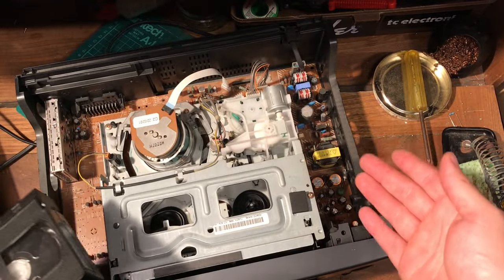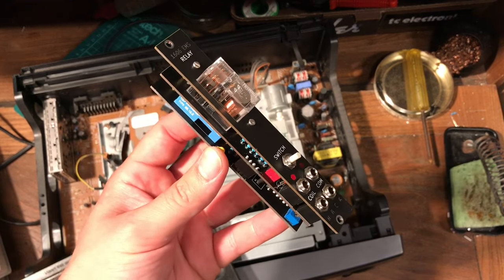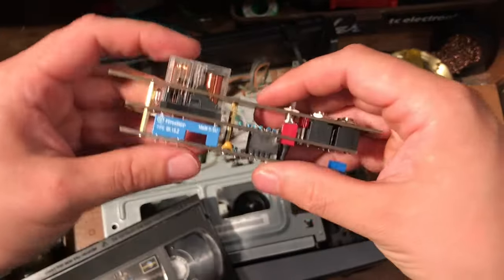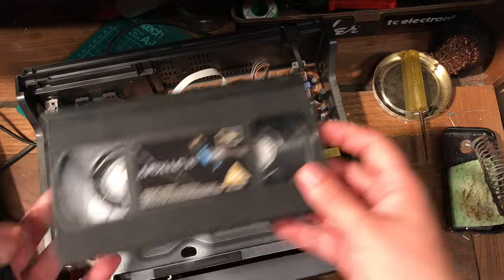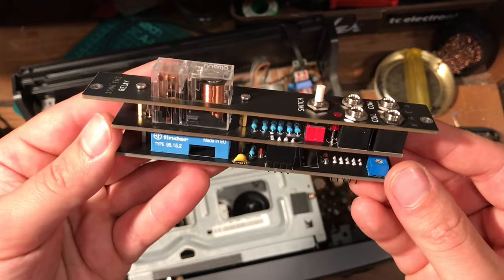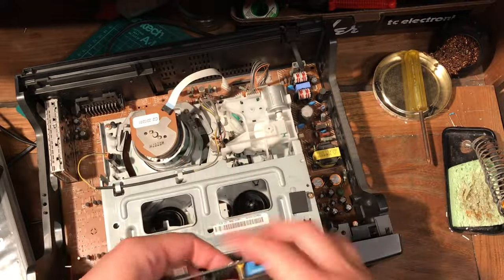Why am I messing around with this? This isn't synthesiser stuff, is it? Well, I've got a festival coming up in Bristol — Machina Bristronica — where we're going to have a hack table full of stuff, and I want to show off the 1606 electromagnetic switch. You can plug in different signals and switch between them with this relay. I want a visual way to show off what it's doing: a TV with a VHS of Apollo 13 playing, switching between that and the hack logo, to show that you don't just have to switch synthesiser signals — you can switch all different kinds of signals, including video signals.